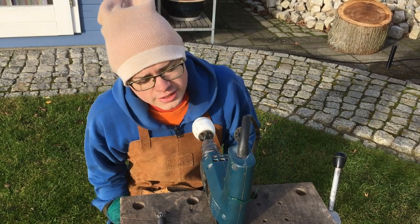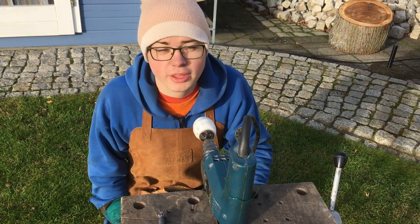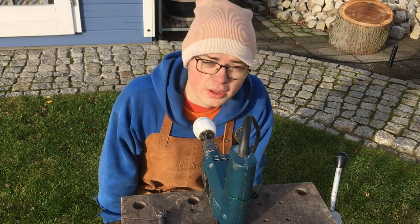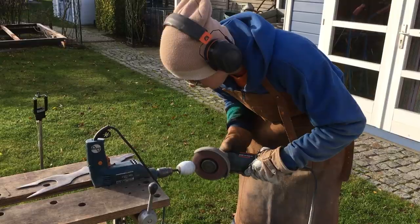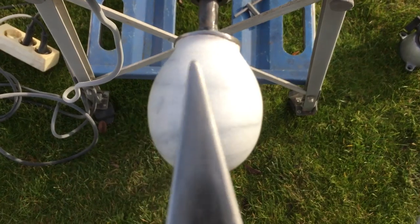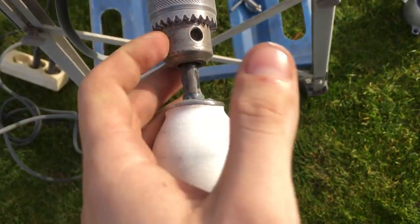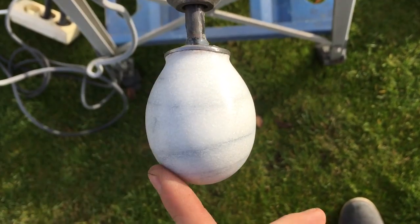I'm going to try it once again. This time I'll have the piece mounted and hold the angle grinder in my hand — maybe that changes something. I hope the glue-up holds. I'll use this piece every now and again to make sure it fits. As you can see, we're not quite there yet; I'm a little scared it'll pop off again, but there's nothing I can do other than try. And now I have a fit that's as good as it's going to get — obviously not perfect because the steel isn't perfect, but I'll take it. Next I'm going to go through several grits of sandpaper and polish this side before flipping and gluing in the end to make it symmetrical.